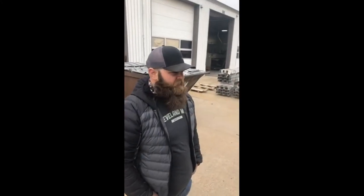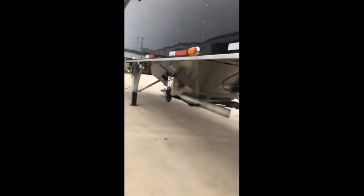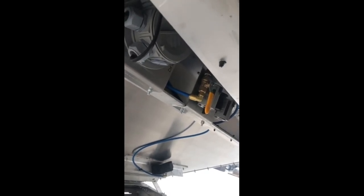Independently from one unit right underneath the middle of the trailer. That's what adds lubrication. It has an emergency shutoff and a water separator. Protects the vibrators, oils them correctly, keeps them running. And it keeps the air nice and clean when it's running through the vibrating system, with the water separator right here. Any moisture comes out.